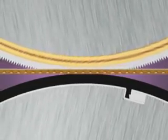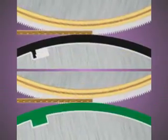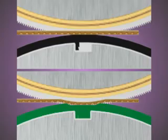This differs from blankets made with a urethane latch design that can produce a soft spot over the keyway, allowing scrap hang-up. Die cutter operators are then required to increase the impression depth of the cutting dies to overcome the soft spot. Time-saver's solid steel lock bar eliminates this potential problem.